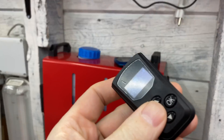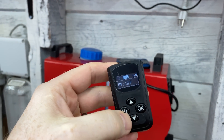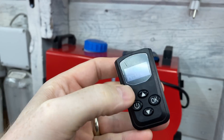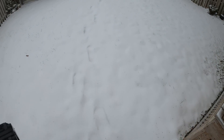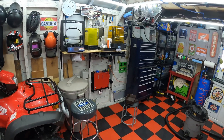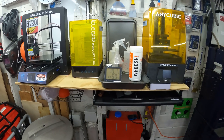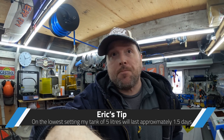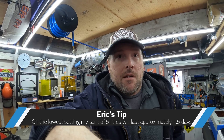There are so many different pairing variations for these, but now we can control this remotely — hopefully from the house — over 433 megahertz, and we'll fire up an Arduino to control this remotely. A little bit of snow outside; we'll see how the diesel heater did. No issues, still on low. 10 Celsius in here and it's below freezing outside — that's a success. That's two hertz it's running at on the lowest setting, so two hertz at 0.02 milliliters. I'll put the math on the screen.